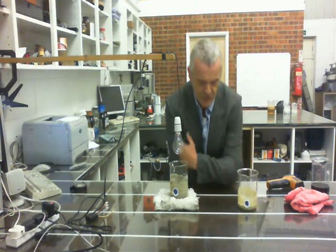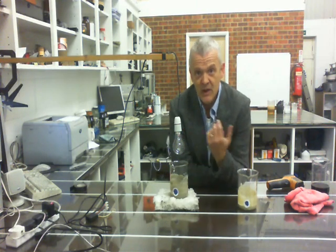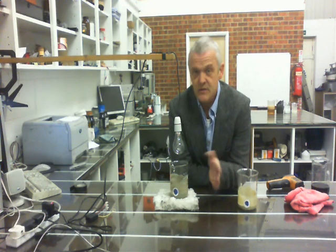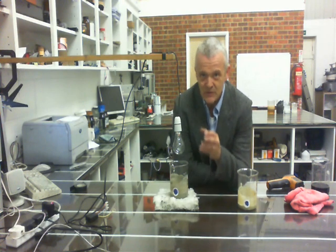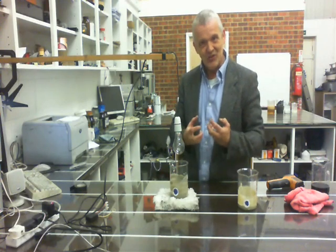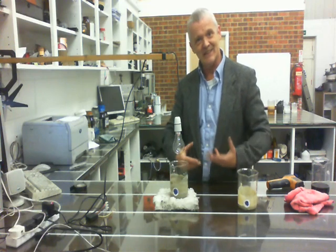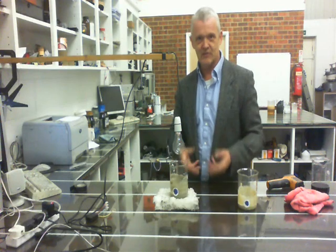Now zeolite is a really interesting substance in that it will absorb an awful lot of water, and we did something on this in absorption chillers. The problem with it is that when you mix it with water it's not actually very thermally conductive. So if you have a big bin of this stuff, the outside can get hot but the inside stays relatively cold, and depending on where you're applying the heat source, the heat has difficulty transferring itself through the mass of the zeolite to get even heating.